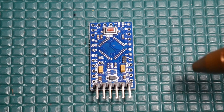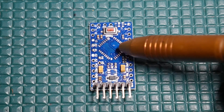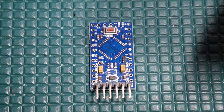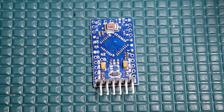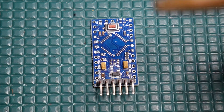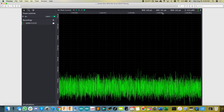I did a lot of these tests off-camera on the Pro Mini. I loaded that same exact code and looked at the current — it was about a couple milliamps. So I pulled off the power LED; there were actually two LEDs on there. I removed them both and the regulator. Tested it again, and you can see the current is 141 microamps. Way, way, way too high.